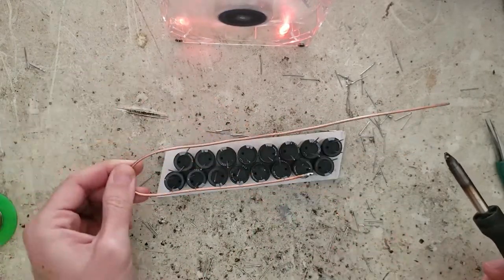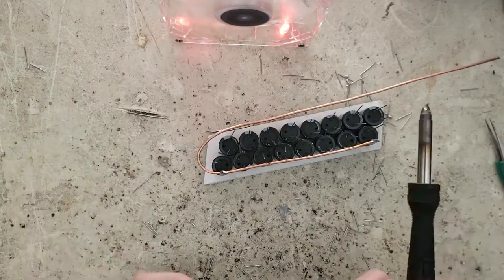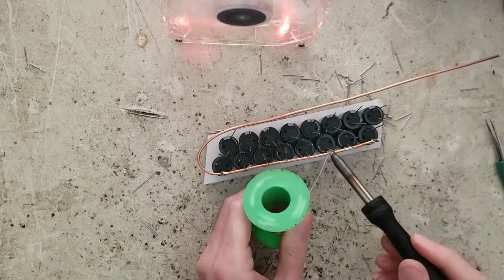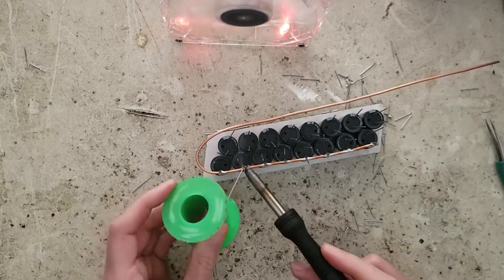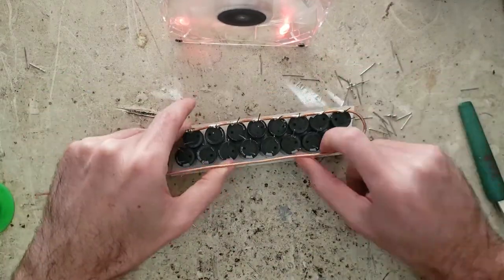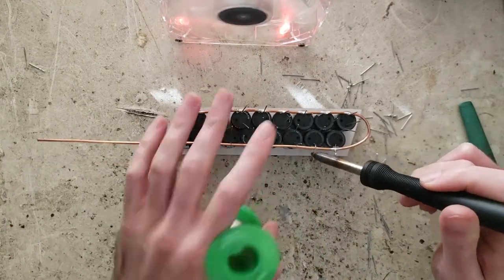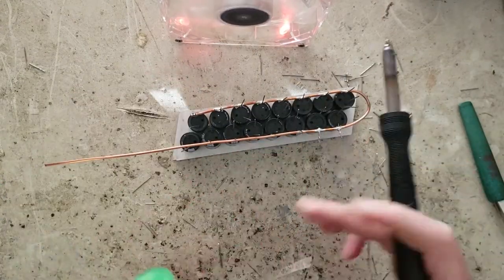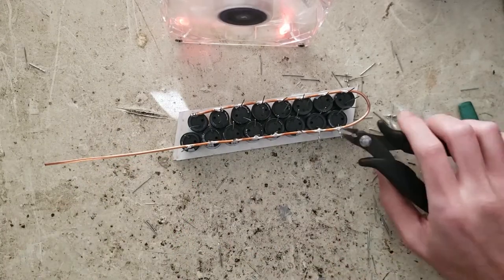1,000 joules is equivalent to running a phone charger for about 1 minute or a hairdryer for about 1 second. It's also roughly the energy in the gunpowder inside a 9mm bullet. These all release about the same amount of energy, but on very different timescales. The capacitor bank should release its 1,000 joules even faster than the bullet does, making it useful for some physics demonstrations and also some really fun sparks.